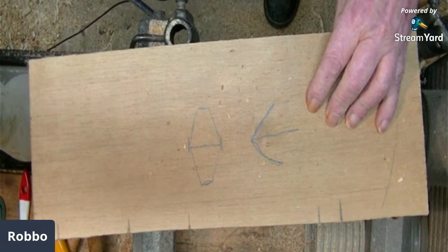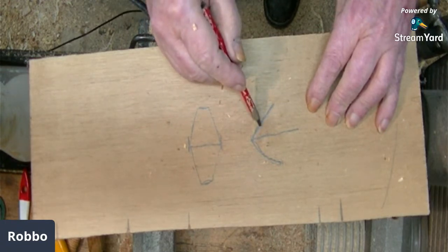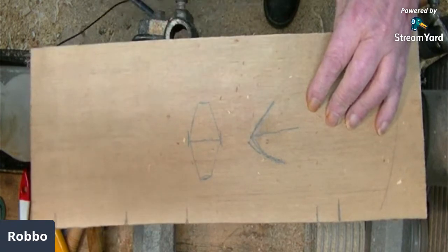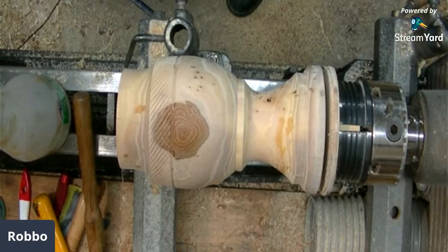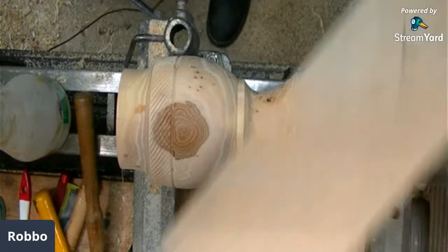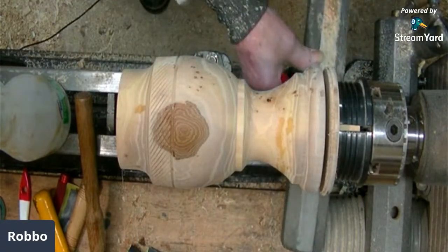And I'm saying, well, nothing much astounds me these days. But the number of people that get the corner right up here somewhere, right away from here, and then wonder why it doesn't cut properly. I find that the most useful parting tool actually is a 7mm, which is my preferred parting tool size, because I can do little fillets with that and everything else.